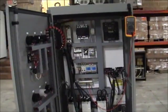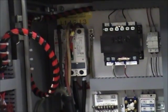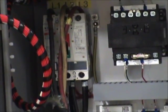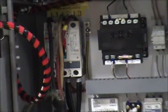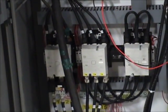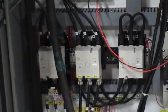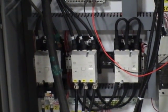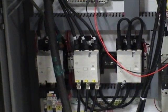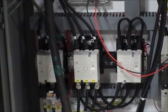With a look inside our control panel, we can see our standard design. At the top left, you will notice our input circuit breaker where the 60 Hz input power will be terminated. Below the breaker, we have the reduced voltage Y-delta starting system that we use to start the motor. This particular motor generator set has a 150 hp motor driving the generator, and at 460 volts it has a full load current of 150 amps. Through the use of our Y-delta starting system, we will limit the motor inrush current on this system to 375 amps, or roughly 2.5 times the motor full load current.